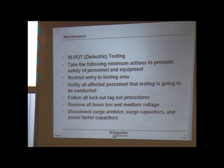Lighting ballasts have caused fuses to be blown on utility poles that go back that far. And that's what I was talking about. How come one of these didn't open up? It's one of those things that it just didn't. But it just took that one little fuse over here, or that ballast, 277, to go back all the way to the utility to blow their fuses.